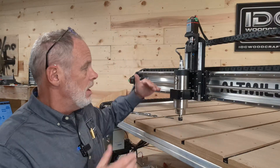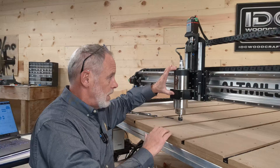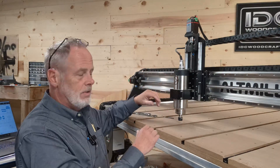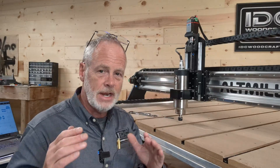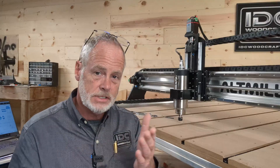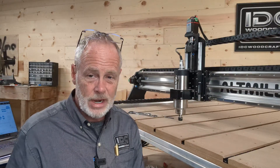The important part here is to try to balance your spindle with the weight or mass — try to split it as evenly as you can from the top and the bottom. You can see here on the Alt-Mill the spindle is balanced in between the two, and I've got it set up very nicely on this machine. Now, if you need to adjust your spindle height to maximize everything, you need to recheck the tram of the machine after you move the spindle, because it might go out a little bit when you're changing the way you're clamping it. Just make sure you double-check the tram if you get your spindle adjusted.